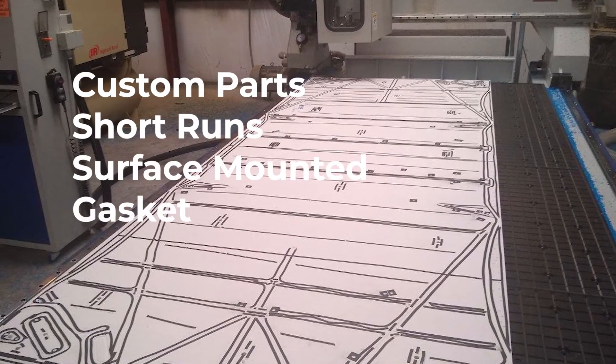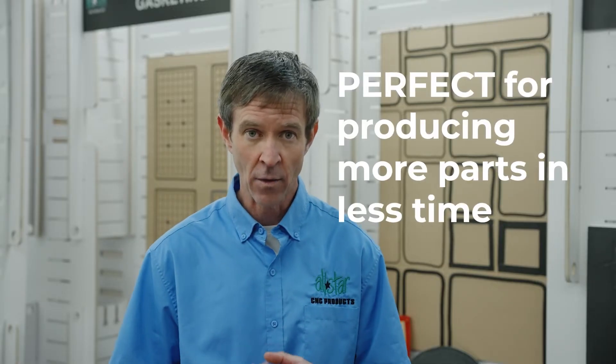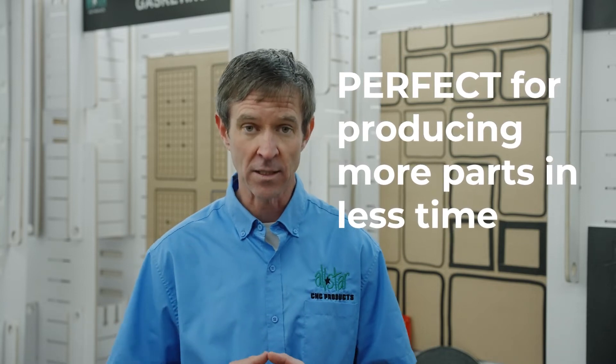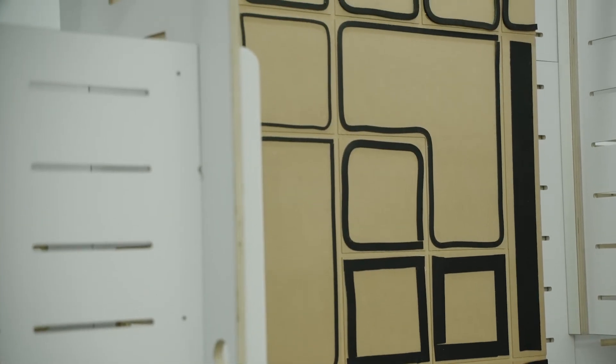When we're trying to increase the vacuum clamp on that piece, onboard gasket is a fantastic way to do that. We're creating a vacuum seal — a vacuum chamber area — that we're going to suck the air out of and really clamp onto that part. This eliminates the need for onion skins and tab cuts, and really gets more parts done in less time.